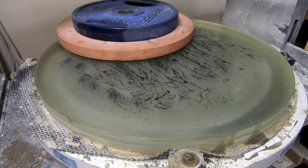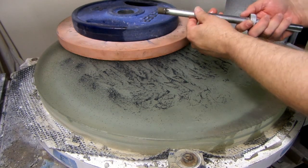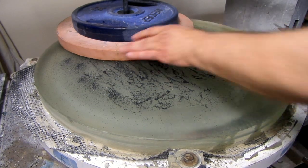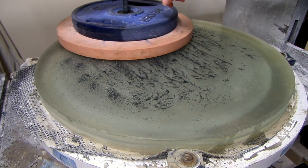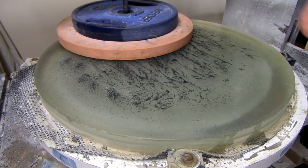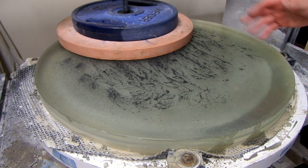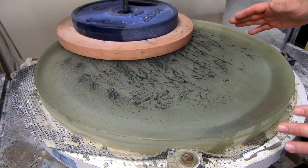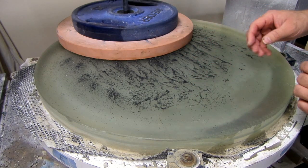I'm going to do something I don't normally do and put this steel bar over the mirror just to show you. This is a stainless steel bar, five-eighths inch in diameter, and it goes down through the hole in the overarm and locks into the back of the grinding tool — that holds it in place. When the mirror spins on the turntable, friction between the two will spin this tool, and the differential rotation is what does the grinding action. I run this up to about 45 RPMs on a mirror this big and let her grind. The trick is to keep adding abrasive and cleaning the swarf off. If it's not howling, it's not grinding.